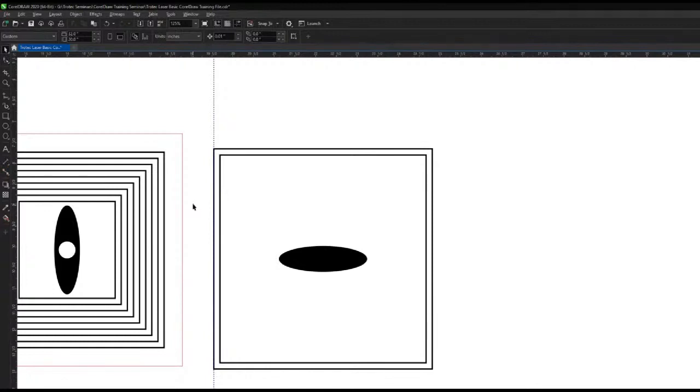That's my favorite. So I just hit C and hit E. It's going to center position. If I wanted center top, I'd hit C T. If I wanted in the center position or in the horizontal, I'd hit E T. So horizontal top. And E R, center right. So use those quick keys or use the snap key to position your graphics one object to another. This does not work if your object is grouped or combined. If it is grouped or combined, the entire object that has been grouped or combined will do that.